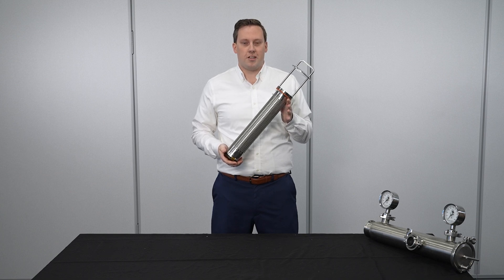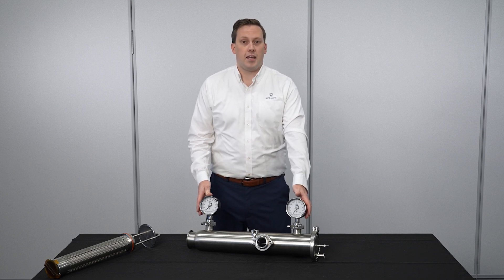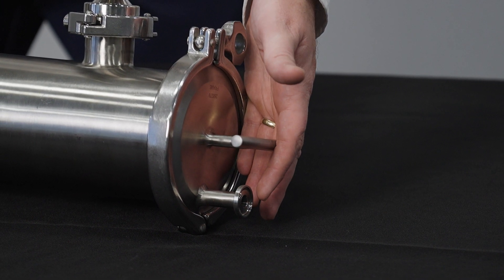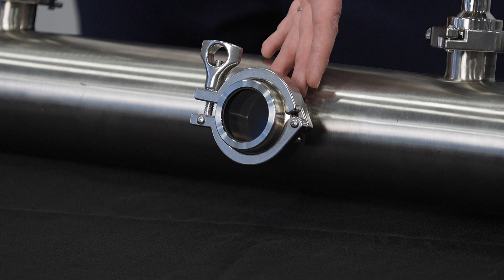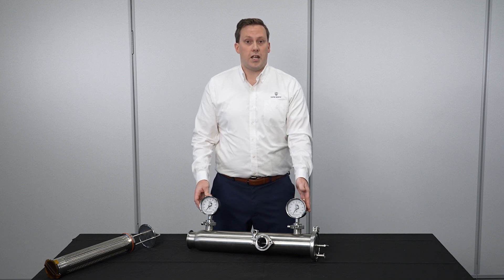Now you are ready for finer particulate capture. The ALB strainer maintains all the same body options that the standard San-O-Matic angle line strainer has: drain or sample ports used for draining or venting the strainer before disassembly; sight glasses used for visual access to particulate buildup; and differential pressure gauge connections for local indication for strainer changeout or cleaning. Having these options built into the strainer saves costs for additional ports in the process line.